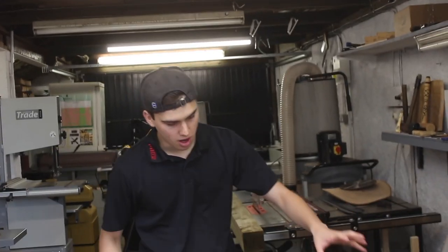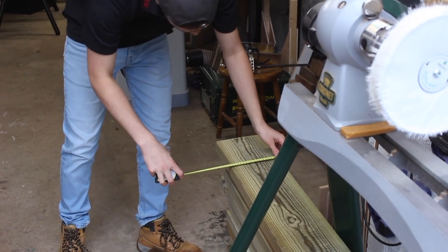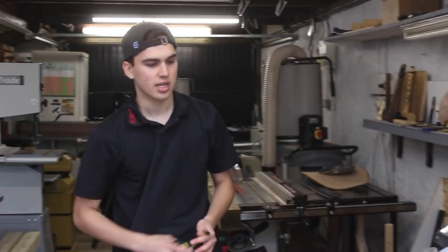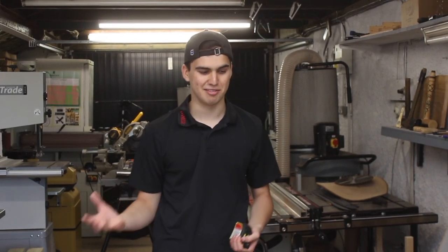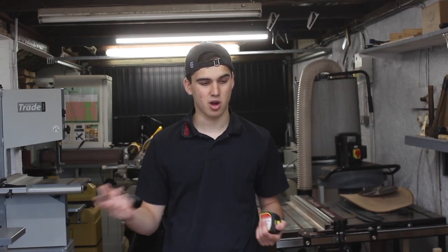Okay, so the first thing I bought are a lot of these boards, which are 7x2s, which is 180mm by 50mm. These were twice the length, but I cut them down in the car park so they actually fit in the car. Now if you have the equipment like a table saw and a planer thicknesser to machine wood up yourself, it's normally better buying bigger boards and then cutting them down instead of buying pre-cut stuff. The equivalent of these pre-cut were £28, but these big boards were 16. So it's worth spending the time to cut them down yourself.